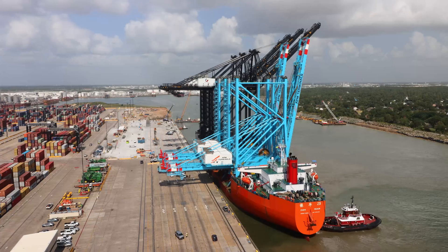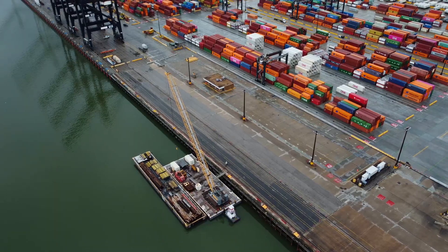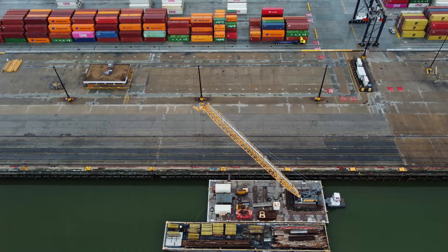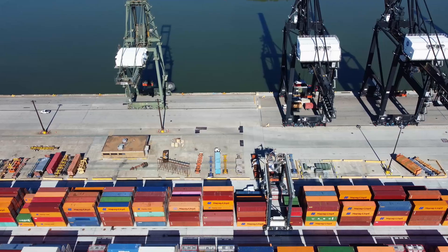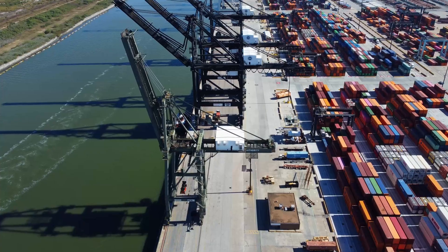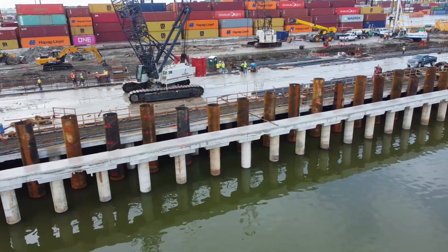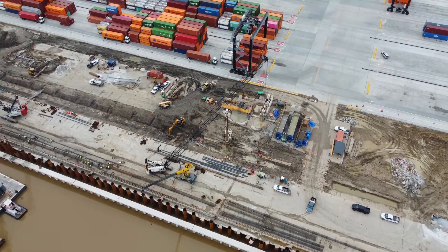Now that we understand what a wharf is and have learned its main components, let us look at the process of wharf reconstruction. We have an existing wharf that is 34 years old, which is not a significant age for such a structure – typically, wharfs are intended to be in service for 100 years. The existing wharf has small, old container cranes on its deck that cannot operate over modern ships as they are too small. The plan is to demolish those cranes and replace them with new, much bigger, modern cranes. To do so, two new lanes of piles need to be added to support the new cranes – one lane at the waterside and the other on the landside.